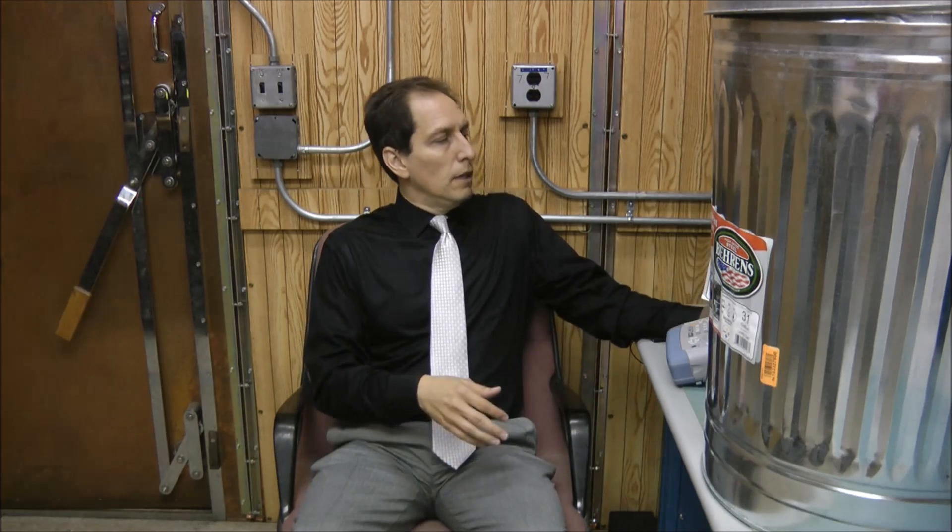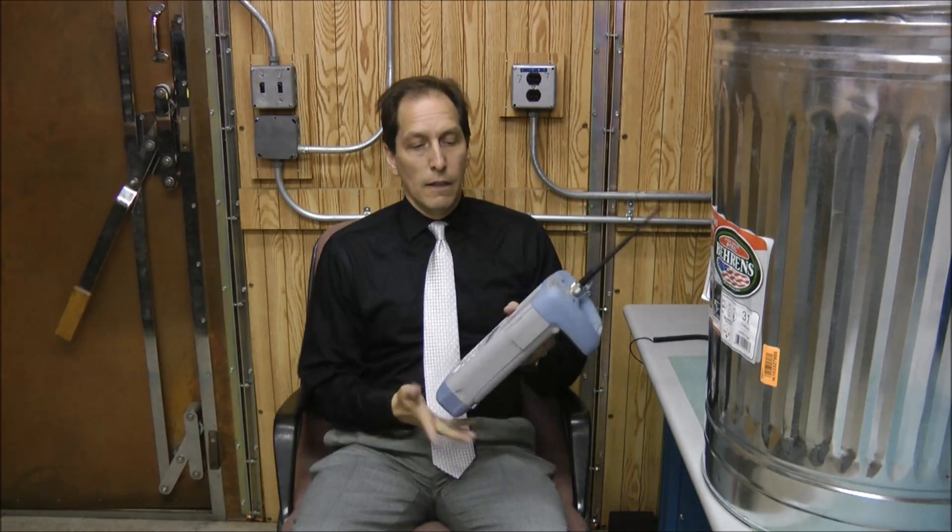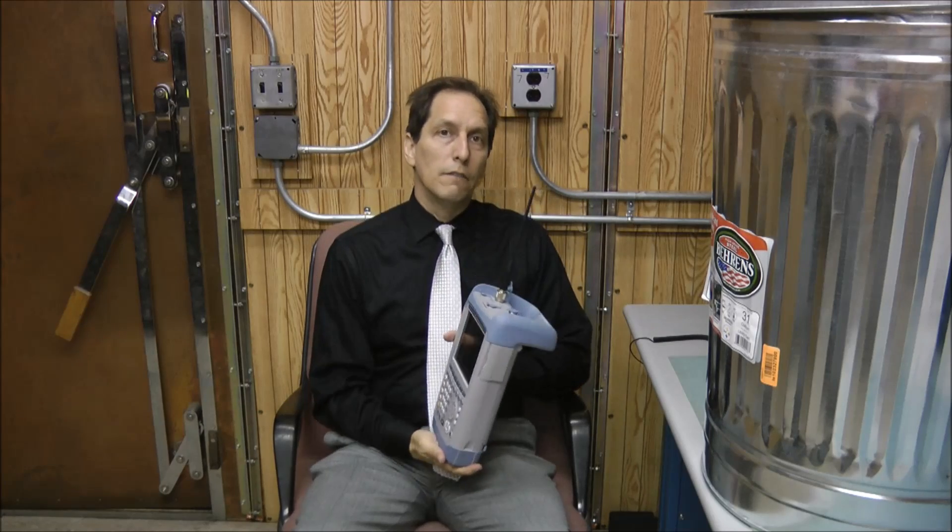Before we get started, let's talk about how you conduct a shielding effectiveness test. You need several pieces of RF test equipment to do it properly, so it's difficult to do at home. You need some way of receiving the transmitted energy and measuring its level. I'm going to use a portable spectrum analyzer that won't have any cables attached, so it can easily fit down inside the Faraday cage. You'll also need a signal generator, an amplifier, and a broadband antenna.